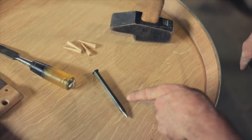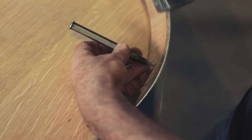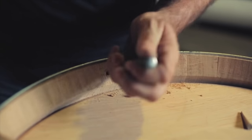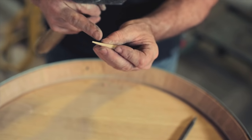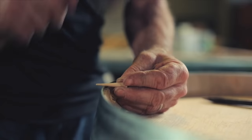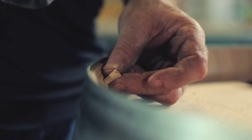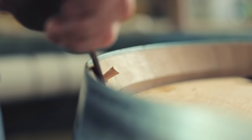I'm going to use the pick here and the hammer. With the pick I'm going to punch a hole where the water is coming through. I'm going to take the pick out and fill the hole that I've made with the spile here — it's almost like a wooden golf tee. Now I'm going to insert it in the hole that we made, and the sound of the barrel tells me that the spile is all the way in. I'm now going to trim off the spile.